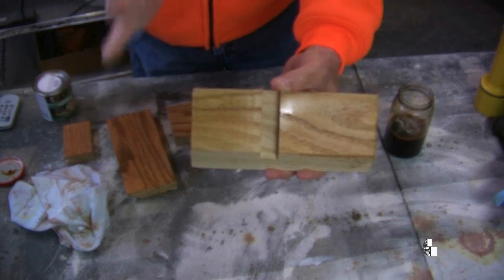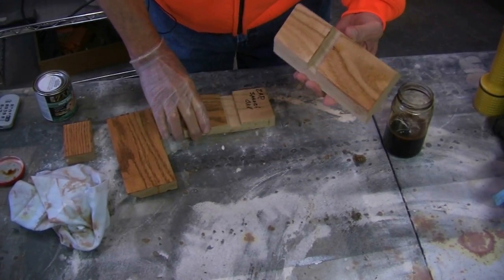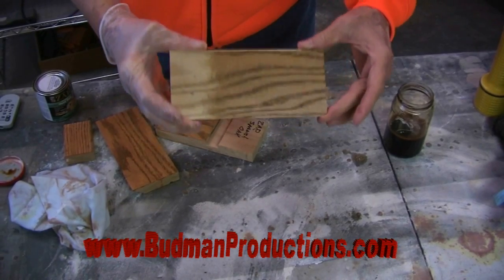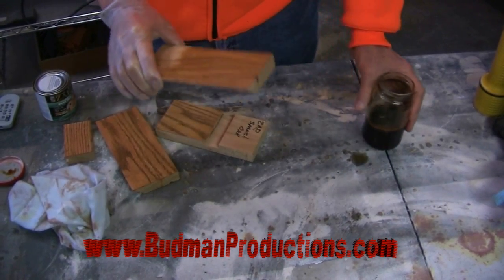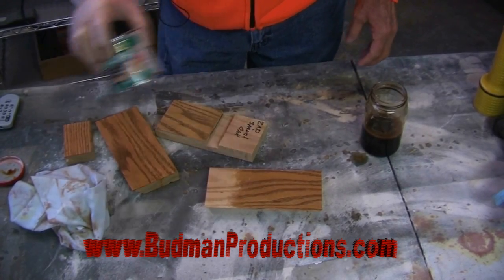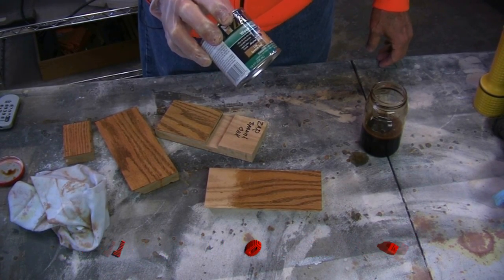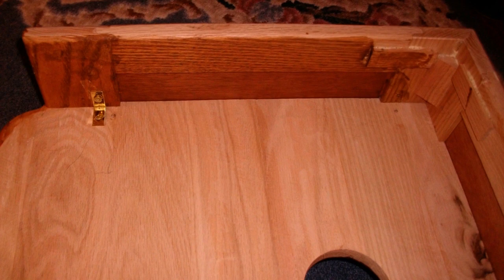That dye gave my finish a background that would show me the depth that my desk has. And when I ended up, I had almost a perfect match — this one — almost a perfect match to the top of my desk, which I'm pretty happy with. This is yellow and red dye mixed together. I let the dye dry and then came back over the top again with some oil-based stain, Spanish Oak. My final step was to spray on several coats of clear satin water-based polyurethane. After allowing the finish to thoroughly dry, I assembled the shelf on my living room floor using just one small angle bracket on the ends to hold the shelf in place.